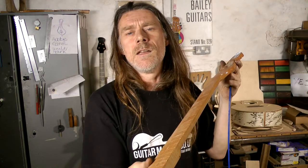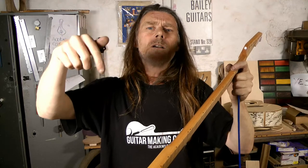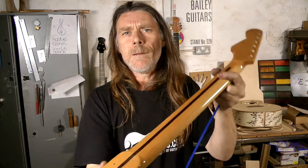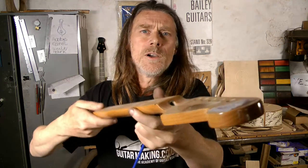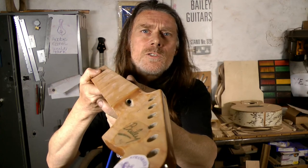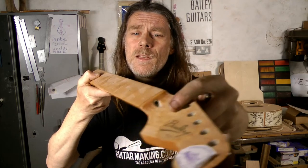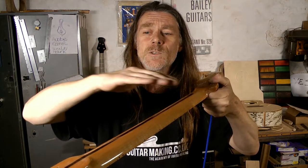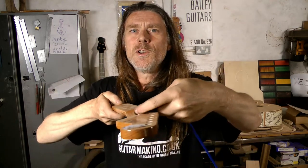So this is a one-piece neck with a skunk stripe. It's a bit more tricky to make. This is why I don't recommend it on the course. But if that's what you want to do, then leave a comment, let me know, and I'll do a video on how to do a skunk stripe. There are several different ways to do it. Different builders do it different ways. What I do is I like to have the truss rod nut adjuster this end, if I'm doing this style of guitar, and then the actual slot is curved, so it's quite tricky to do. You have to machine a curved slot and then drill through to join up with it.